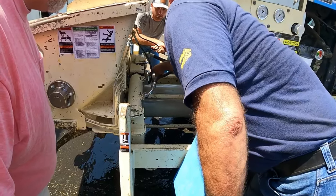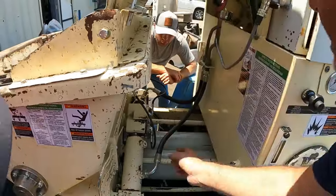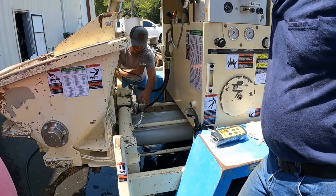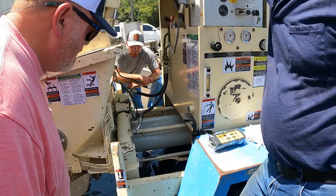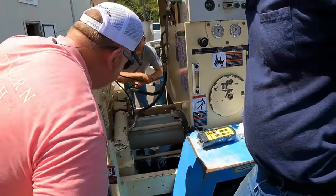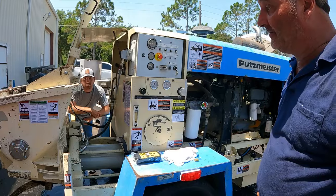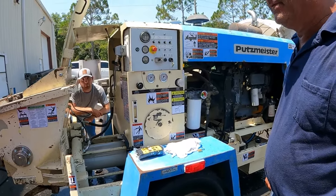And then you're going to go see where the retaining nut is here. This is a flat, so you're going to tighten it one more flat here, and it'll give you about a 16th, or the size of a quarter. So you're going to do this from this flat to this flat. And then you're going to put everything back on. Real simple. And this is about once a year. If you're pumping 16 jobs a week, you might have to do a little bit more than that. But on the average, probably 7-8 jobs a week, about once a year, you're into it.